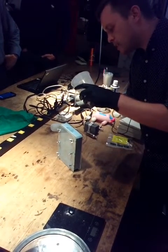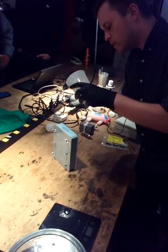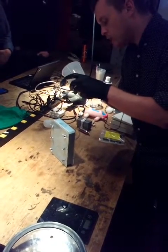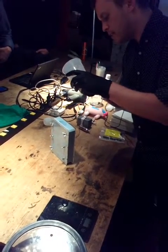This process should only take about 10 minutes. Unfortunately, this silicone has about a 20-minute pot life, so if you do take your time, it will gel on you and not go into the mold. It won't cure for a while, so you'll just be staring at it and not able to do it.